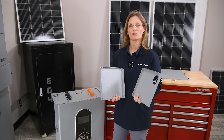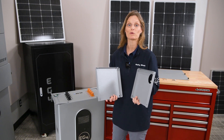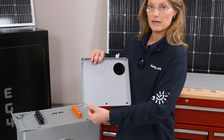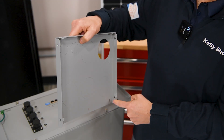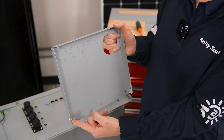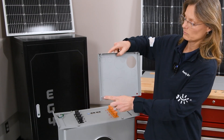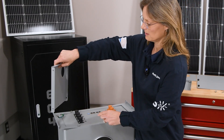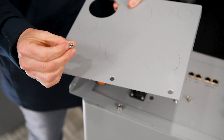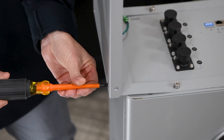The next step is to install our side plates, and there are some really important things to keep in mind when deciding which one goes on the left and which goes on the right — make sure you orient them correctly or you could run into problems. The open face on the bottom is your bottom side. Your back side will be flat on the back. Your top and front will both have the protruding pieces, and the back side of the threaded inserts will go on the front and the top. A nice design feature is the recessed hole for your M6 flathead screw — when installed correctly it will sit flush to the face of your side plate.